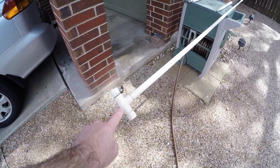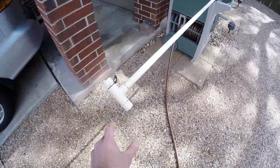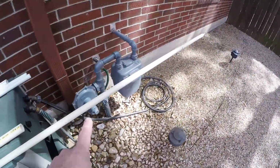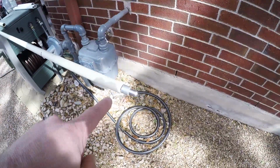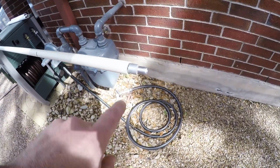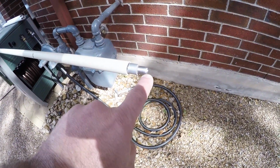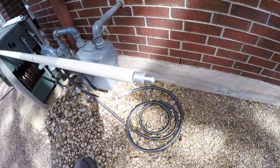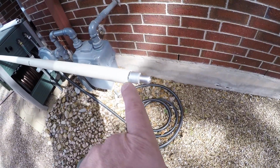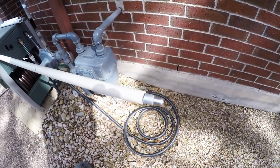The CPVC is a simple T. I just cut a small section to keep that tight and not too wide. Again, 9 foot. Inside, I have Sikaflex pulled all the way through, like 3M 5200. This isn't going anywhere. And this is the half-inch stainless steel with JB Weld. I actually notched the inside of the aluminum and scored the stainless as well.